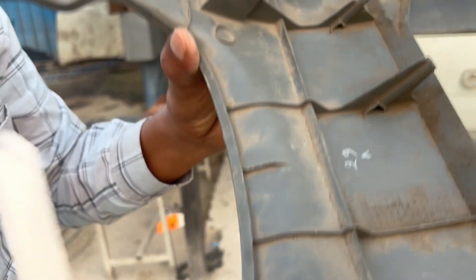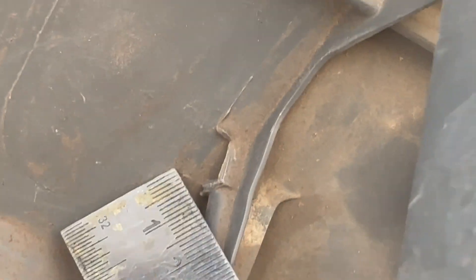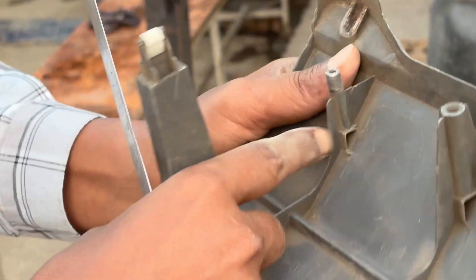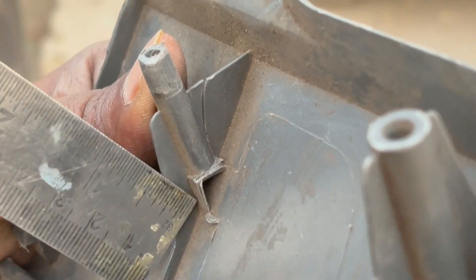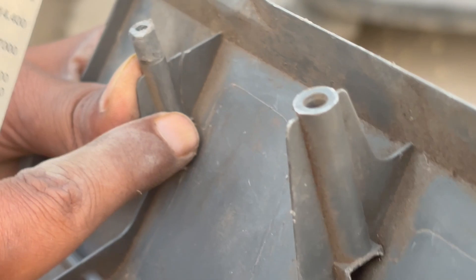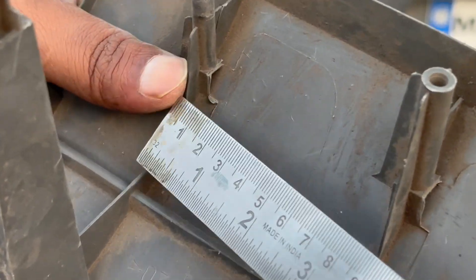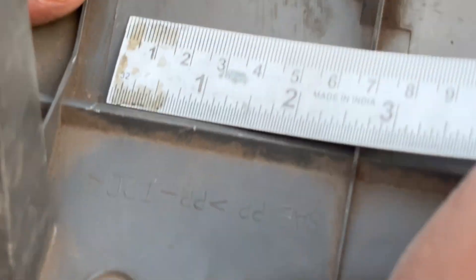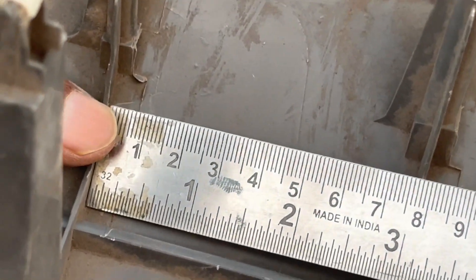Someone may consider this a weak steel because the height or thickness of the steel is only 5mm by 7mm. If you get 5mm at one side and 7mm at the other side, it does not become a weak steel. We are able to provide a doghouse with 5mm at one side, and if you increase more than 4mm that's also okay. The undercut size is 5mm, and the lifter travel box is: undercut × 2 + clearance + 25mm block size.